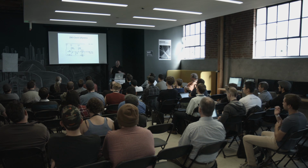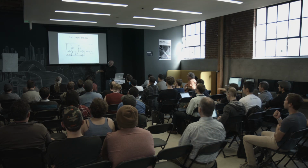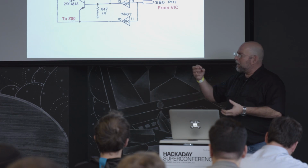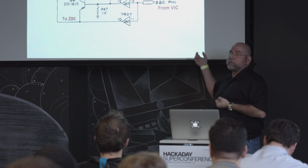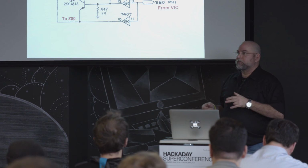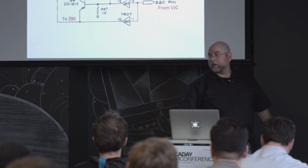I mean, and by the way, we fixed a problem before the next sunrise every day. Whatever the problem was the day before, to stay on schedule, we had to fix overnight. So the next morning, sun comes up, and this is what I have. Don't worry about how it works, just know there's 12 volts in there, right? I walked around to chip designers. I walked around to the fabricators. I talked to the guys that know how the bond wire sticks to the silicon, because I was afraid it'd crack under a stress that I've never even figured out. I'm afraid, what if after 1 million, the next 1 million transistors don't work right? Because I'm using it totally illegally. What if after 1,000 hours it stops working? I'm picturing people's Commodore 128s on airplanes and they start blowing up. I still get an ear bleed, blood actually out of the ear when I look at this circuit. Who puts 12 volts in a logic, right? But we had to fix one thing a day.